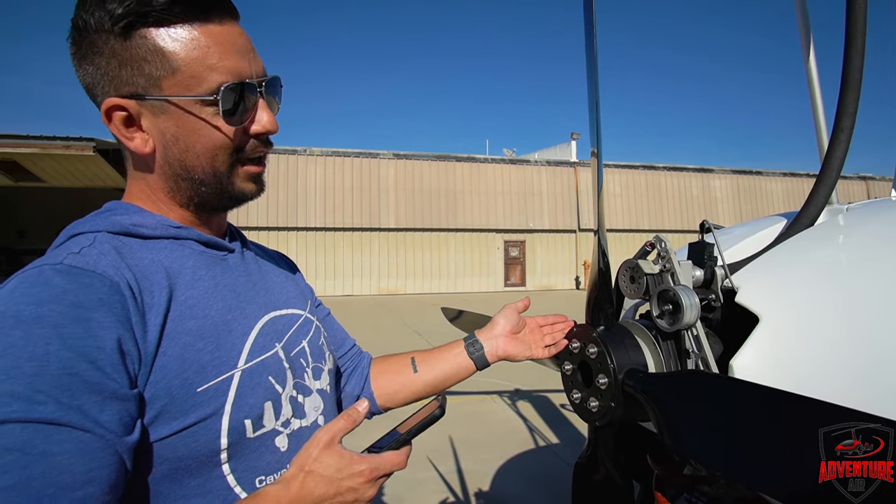So you added washers to those two bolts right there? I did, and they slightly improved. But what we're thinking is: we took the propeller apart, we weighed each blade, we got them statically identical down to the gram, and we're trying to balance it right now. But we think the machine was flown the last 100 hours with a pretty poorly balanced propeller, and it's worn out the motor mounts. I can wiggle the engine pretty easily by hand with minimal force, so I don't know that it's actually the propeller that's out of balance — the motor mounts are just loose themselves. There are signs of them cracking and they're worn, they could just be shot, they're really soft. Rubber breaks down.